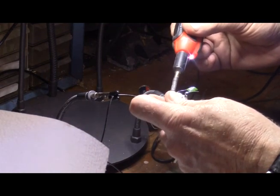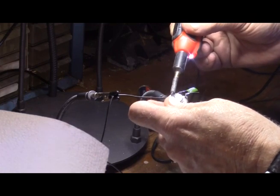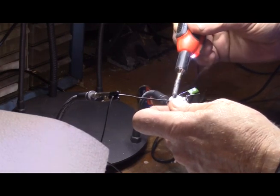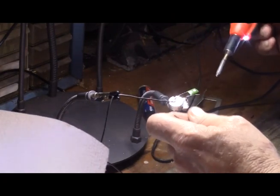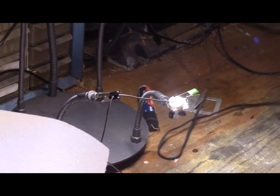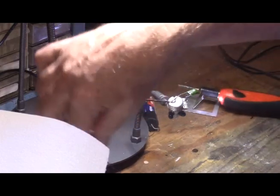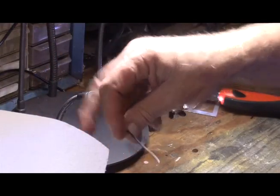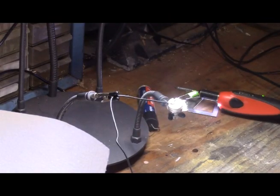Okay, now we get a little more for the capacitor lead. It's not cooperating. Get in there. All right. That is a good, solid connection. So, this black wire will serve as the bridge ground wire, but I'm not going to strip this end yet because I don't know how much of it I need, and hence how much of it I need to strip. So I will wait until it's actually in the guitar to determine that.